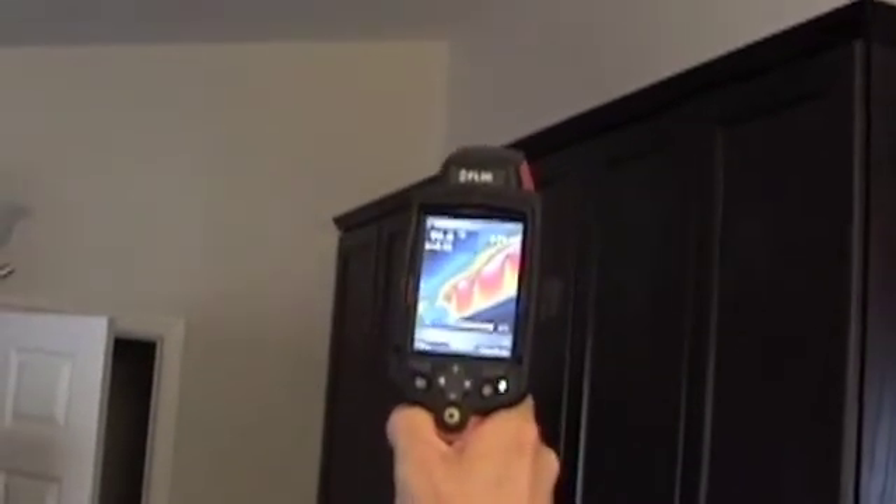So we're looking right above the cabinets inside the kitchen. Can you show us with your laser again? So on that inside wall — on an interior wall — you're getting spots where it's over 100 degrees in the house at 75 degrees because of missing insulation. Yep, missing or just improper insulation.